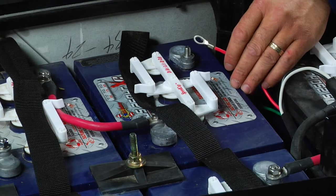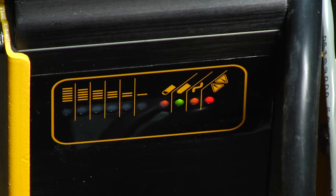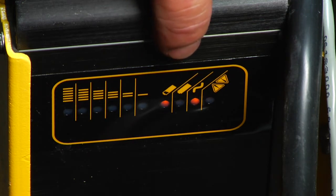Note that at this point, you will need to have precise timing in order to correctly set the algorithm. Once you have identified the LED, have the second person plug in the AC charge cord while you view the LED and hold the small gauge red wire. The entire LED bank will flash quickly, then the three-quarter shaded battery will flash the current algorithm.